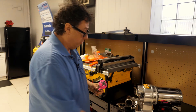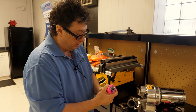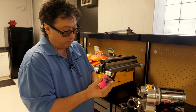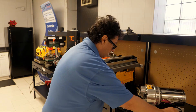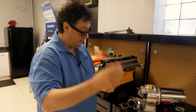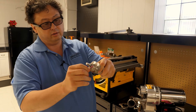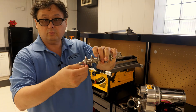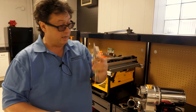These are very sharp, so we want to make sure when we go to clean it our hands are always away from the blades. We can pull out this cutting knife like that, and you can take a look at the auger. The auger is stainless steel, but you could imagine this is pretty painful — if it grabs a shirt sleeve or starts on your hand, you're not getting out of this.